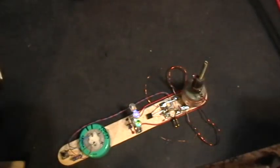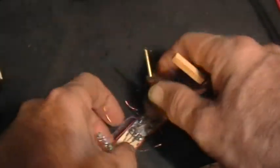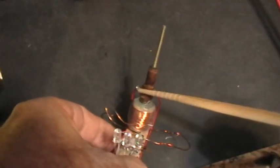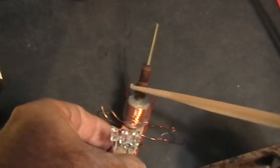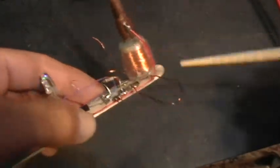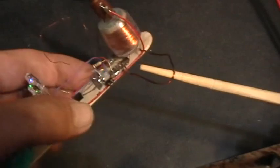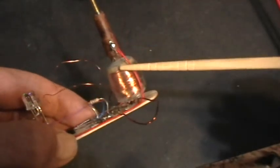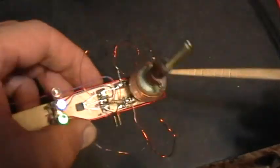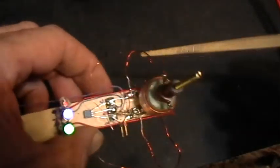So what I did was I took an ordinary loop stick. Its main Litz wire coils are terminated in these two little ears here, and I wound two extra coils on top of it. I took this heavy magnet wire here and I wound one layer of 20 turns on top of the Litz wire coil, and then I potted that in epoxy, and there are its two leads.